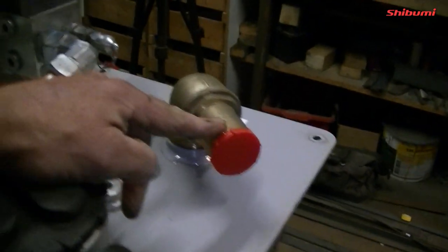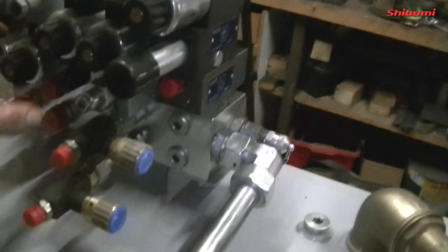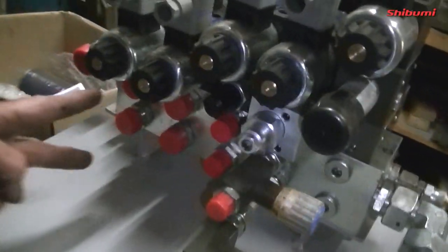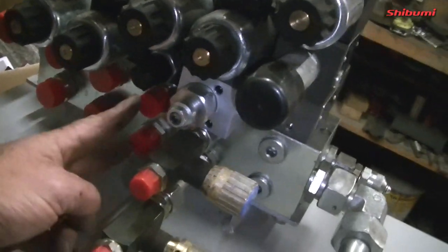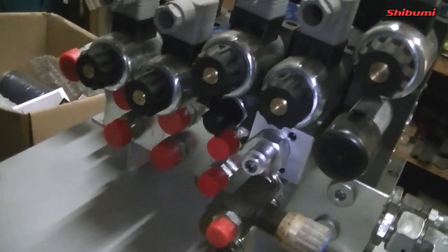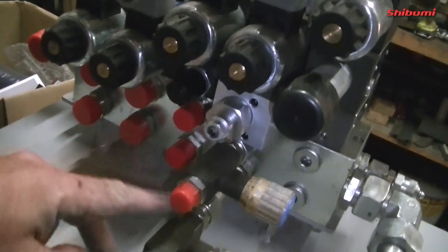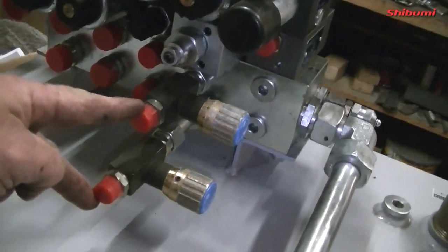That's just an ordinary hose. And then the high pressure line coming back in is back in over here. So I can route this in and come in this way into it. And then all of these will go off to the bow, the bow thruster and the windlass, and then that's to the stern. That can go up out through the roof of the bulkhead or the engine room. And then also the same, these can go up the walls to meet the radar arch.